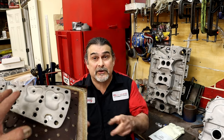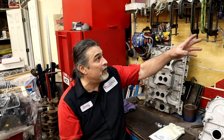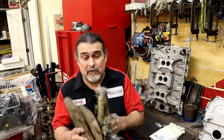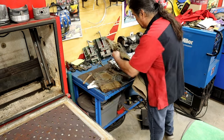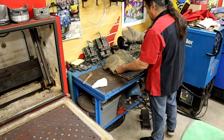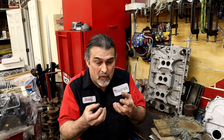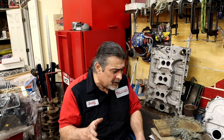For aluminum thicker than a quarter inch — cylinder heads, intake manifolds — it's going in the oven. I preheat it in the oven, bring it to my table, and lay old gloves on top to keep the heat in. I'm not using the TIG welder to preheat — I let the oven do that work. Then I use the TIG just to weld. Because it's already hot, when I crank down on it, it won't burn the top layer off. That's the tip for welding thick stuff.